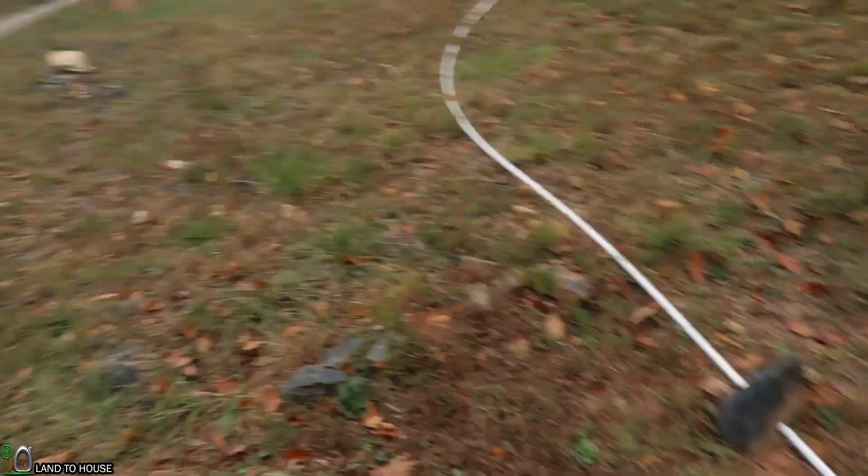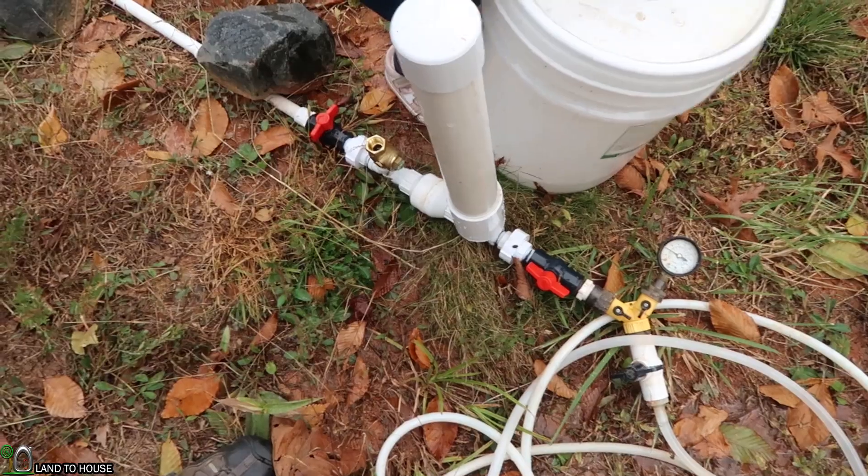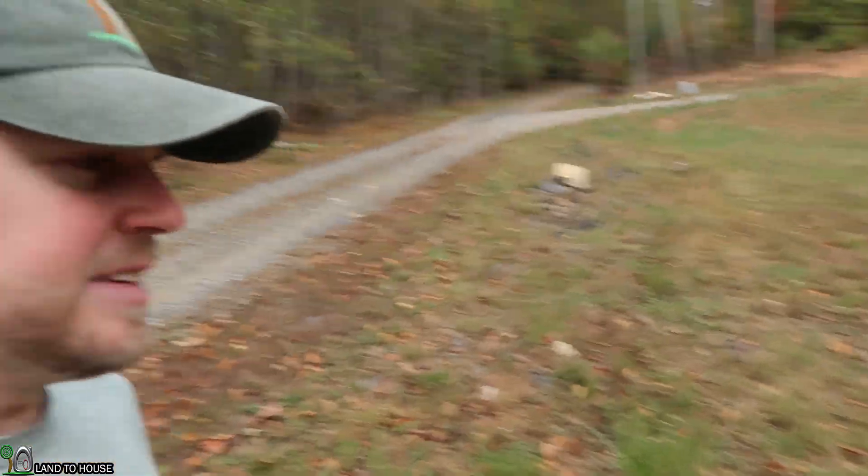A couple of thoughts here: I know that 90 degree fitting up here is slowing this down tremendously, so that's going to be an issue. But it's 40 PSI versus 64 PSI, so it's significant. The cycles were much faster. As I was predicting, when you step up to a larger drive pipe, the pressure wave is dissipating faster and faster as it goes up the pipe, and it just reduces the efficiency a good bit.